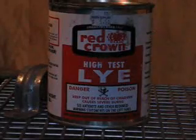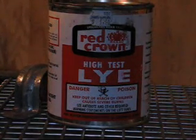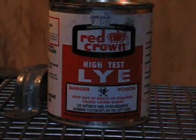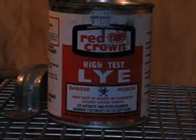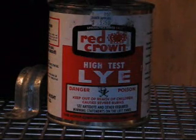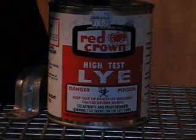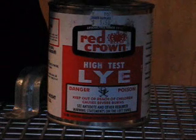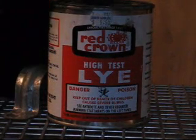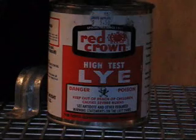A lot of people use baking soda. I don't recommend it because there are things in baking soda that will end up sticking to your plates, rods, or wires, and eventually your generator will cease to work. I suggest sodium hydroxide or potassium hydroxide if you can get your hands on it. This sodium hydroxide keeps the plates from rusting out — which will happen if you use salt or baking soda, which can rust stainless steel plates. It preserves the plates, enhances the conductivity of the water, and doesn't leave your water all murky like baking soda does.